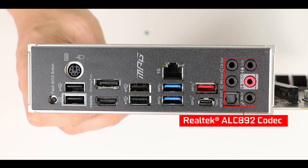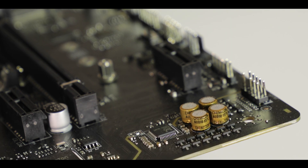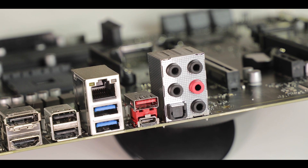Finally, we got our mid-range 8-channel ALC892 audio codec, which could have been great — or at least good, even though it's mid-range — but because it's only four PCB layers, and despite the fact that both left and right audio channels have been traced on dedicated PCB sheets, it's not great. It is prone to static interferences. There's not enough PCB layers to protect and isolate it from poorly grounded houses. So if you're looking for real good audio quality in gaming, this won't necessarily do the job and you might want to invest in a dedicated audio solution.